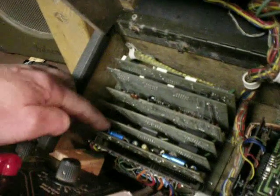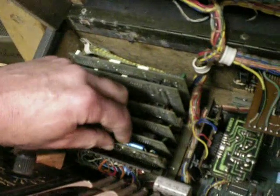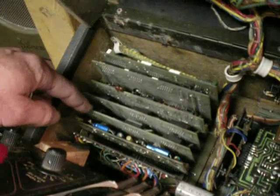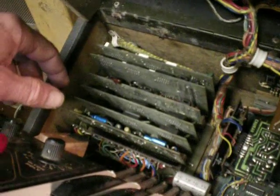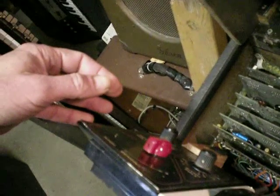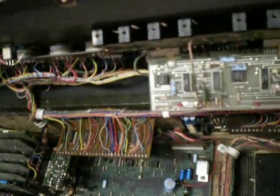This one is your tuning of your two oscillators. I actually hooked up wires so I could tag onto them to test them. The DCO uses 74LS-221 chips, some charge control, and your bender — I've got a temp bender handle here. I had to build a spring for this thing too; the spring broke. Got it working pretty good.